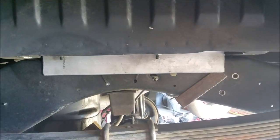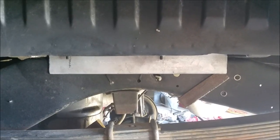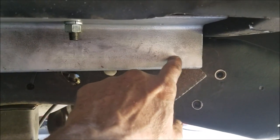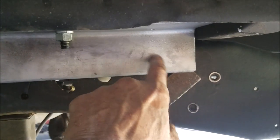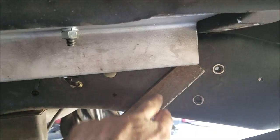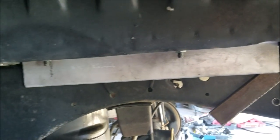This part of the frame has a dent in it — it's got a bump and then goes flat the rest of the way. I put a quarter-inch shim underneath before I tighten these up. The reason I'm tightening these up now is because I'm going to go on the other side of the frame and drill the holes where I want this bracket to go. After that I'm going to take my shim, put it in the two holes for the cross brace — just utilizing the same holes — weld it, re-drill the holes, and I'll show you that when we get to that point.